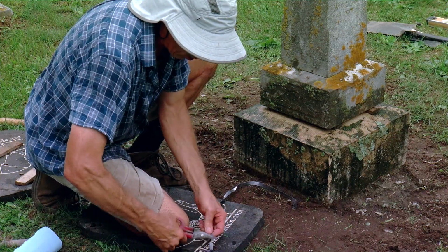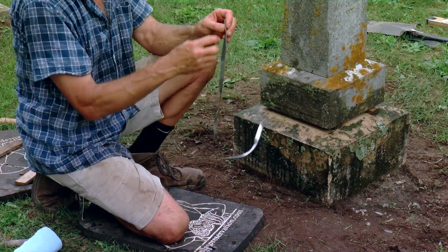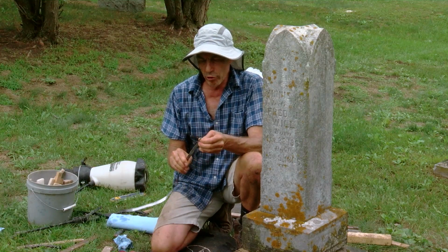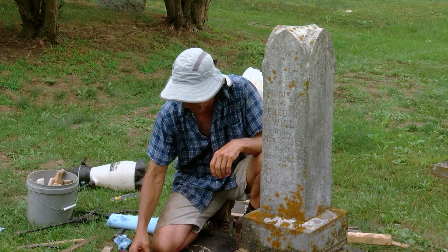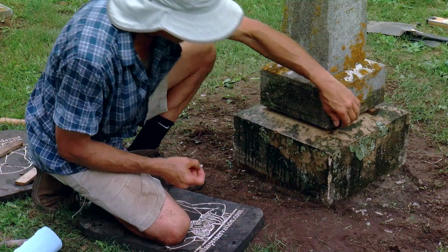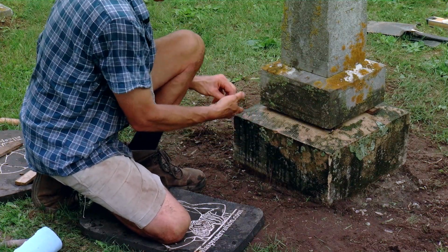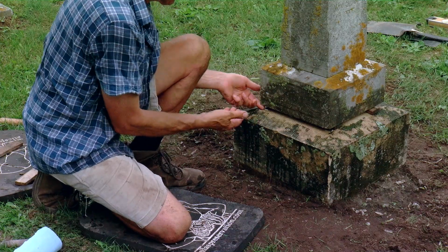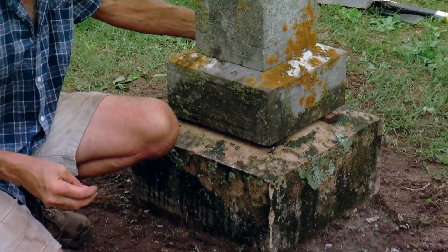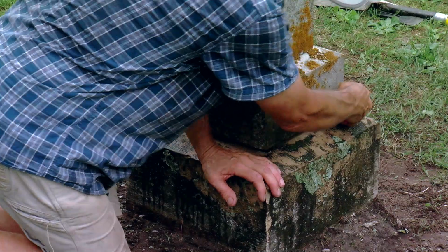So we're going to cut 4 little clips of this. This is number 2 wedge lead, which is a maximum of 1/8 inch thick, and it tapers down to 0. There's also number 3, which is 3/16, and number 4 is 1/4 inch. Number 1 is 1/16, but it hasn't been in production in a long time, and we're looking to bring that back into production for some specific applications. Generally speaking, they go with the thicker side on the outside, closest to the corner. We're going to put 1 in each corner.